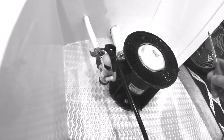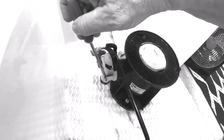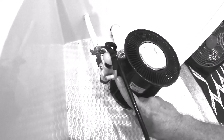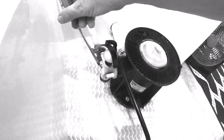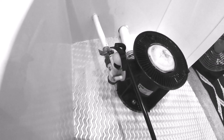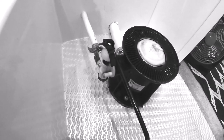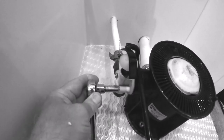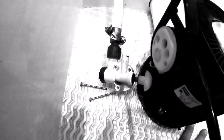Next we need to get the ball out. There's a little shaft that goes in there, but we have to get the pump off first to access the inner spring, which we're replacing as well. Following the instructions, I'm removing these two screws from the pump — they're in a tight spot with not much clearance, so I'm using my stubby screwdriver and taking it easy since it's plastic. I found the 5/16" ratchet fits, which speeds things up. Got the pump off.